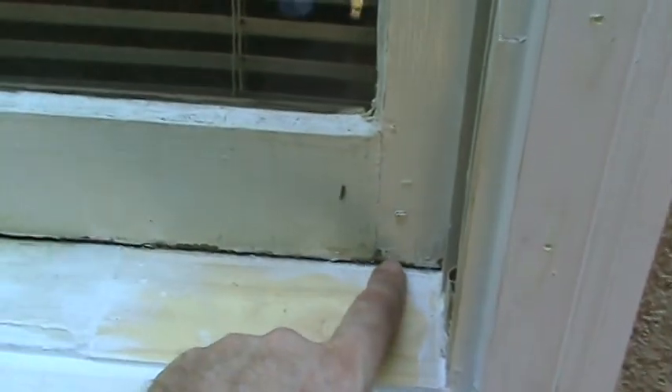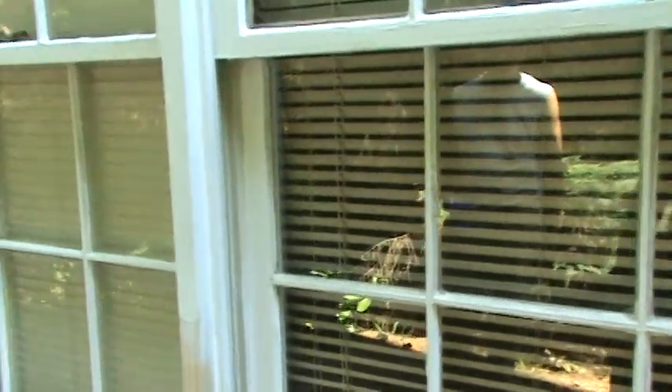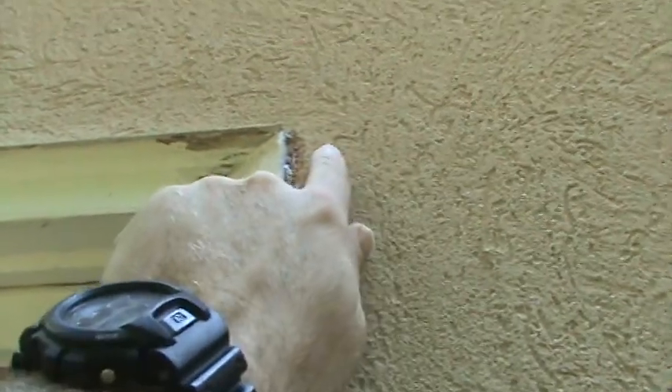When you're looking at these windows — and we come up with this time and time again — look at the lower sash in this window right here. See where it's starting to rot? See the gap right here in the frame? It's never been caulked with anything other than paint. It's a little more pronounced on this side — it's actually starting to rot in the window. This homeowner is going to have to come through this season and repaint all the trim on the house, then wait until next season to repaint the whole house. If you hand paint it with premium materials, his house will be in great shape for a good 15 years. The flashing is cut short here — it should be way over here, see where it's cut inside of the brick mold? You can see where our crews came through and clear-caulked this with a clear caulk. So all this trim will get cleaned and repainted, but you're getting to see the carpentry at this level right now.